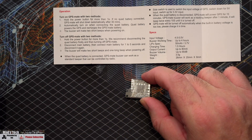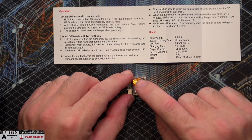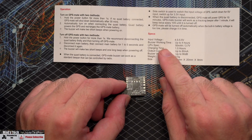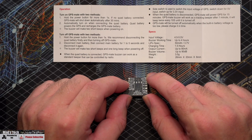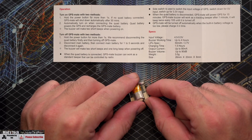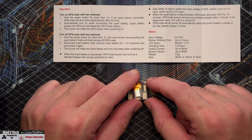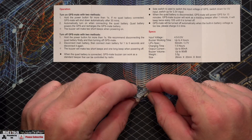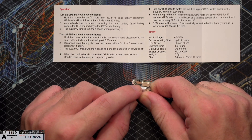When you connect your flight battery to the quad it will simply power this unit and begin to charge its battery while passing power through to the GPS as well — the idea being to allow you to get a GPS lock without wasting your main flight battery. There's also a switch which allows you to select between 3.3 volt and 5 volt depending on your GPS system voltage.